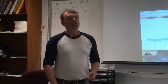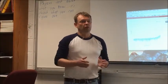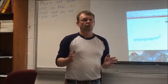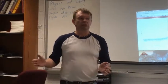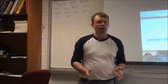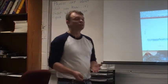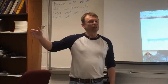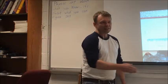There are two situations. In the first, you have a sweeping generator, very stable amplitude, controlled, and you use a resistive divider. One part of the signal you send to this amplifier, the second part goes somewhere else. But you need stable amplitude, you rely on this. And accidentally you forgot to terminate the output of this amplifier. What happens? All the power gets reflected. You have 20 dB amplification on the way up, and the reflection gets 20 dB attenuation on the way back. You end up with an oscillator.